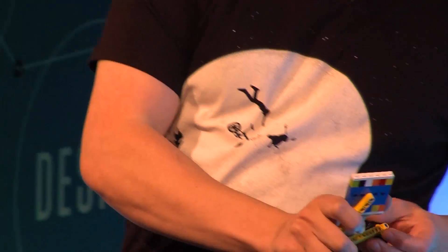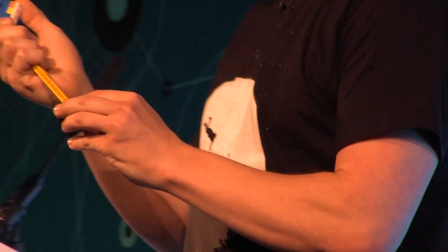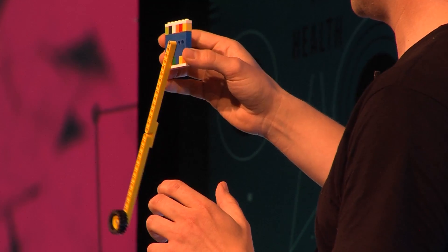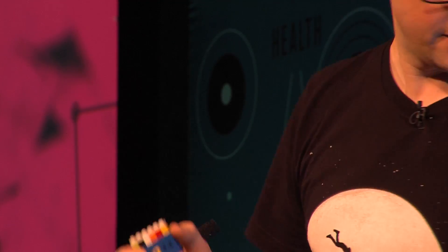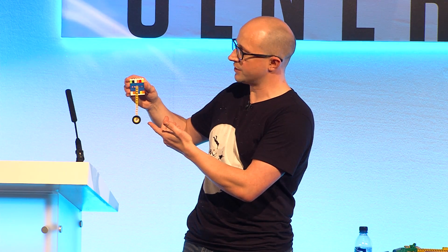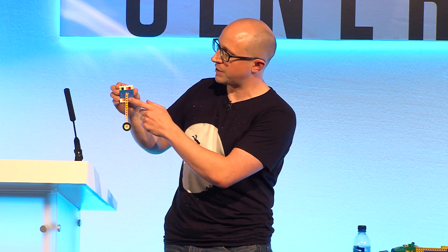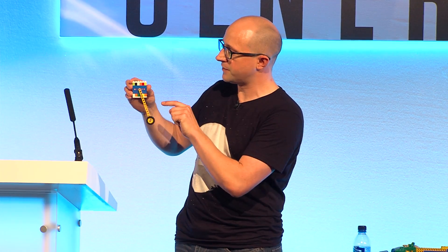The property of pendulums is that if you shorten the beam, they'll run faster. And if I shorten it even further, it runs even faster still. So I can use that property to adjust the speed of my clock. But the problem is, you can see it's just come to a halt — there's friction in the system. The plastic's rubbing together, there's air buffeting it. What I need is some kind of energy source that gives it an extra kick to keep it moving.